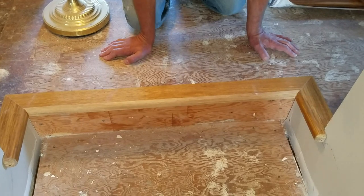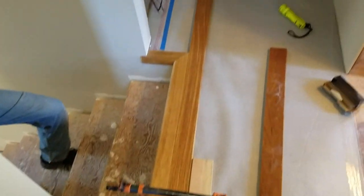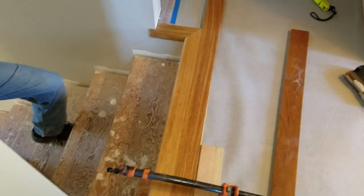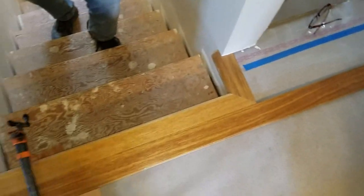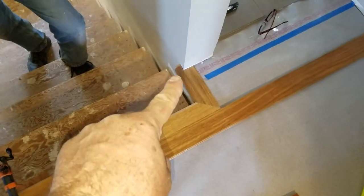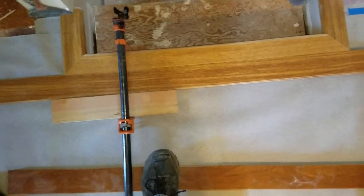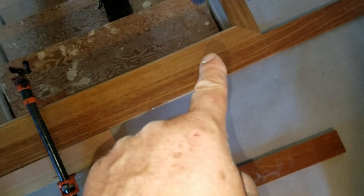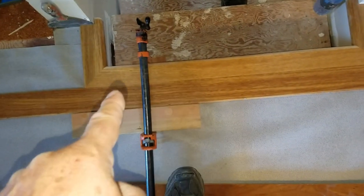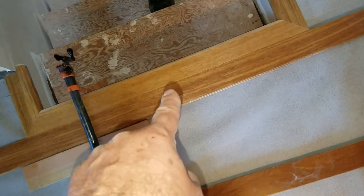Here is what we're doing to start our first row off of the opening — the bullnose for the stairway. You see how we have the stairway bullnose returning into the walls. There will be some decorative posts coming up on either side. We've got some L-nails in the leading edge of the stair nose, and Dave was backing that while I was standing on it and nailing it with the floor nailer. So we've got four nails going across that and two in each end.